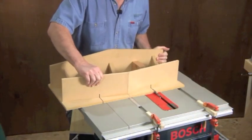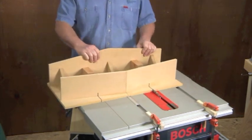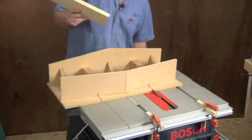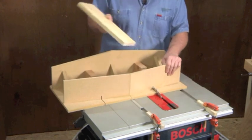To begin the cutting process, place your dovetail sled in your table saw's right hand miter slot and clamp two blocks in the slots to limit sled travel. Now use one of your pin boards to set the blade's depth of cut.